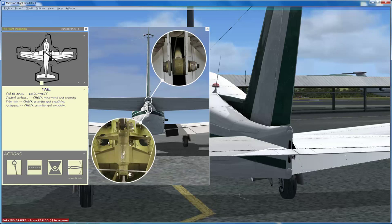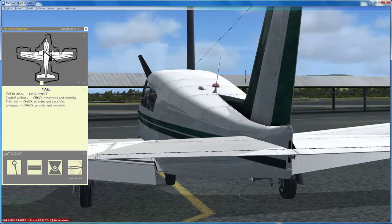The reason for that - when I spoke to Navy engineers many years ago - it's obviously more pertinent on an up-and-down bolt than a left-to-right bolt. If you imagine worst case scenario: somebody's done maintenance and pulled the split pin out, and then with vibration the nut works loose. If the bolt were at the bottom it would just fall out. With the bolt at the top, if the nut works loose, the bolt is still held in position by gravity - so there's a possibility the bolt remains in place adequately enough that you can land.